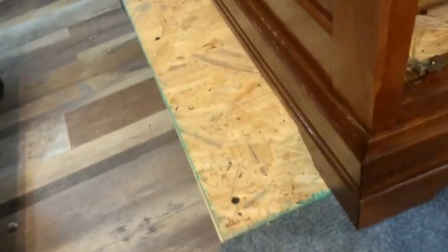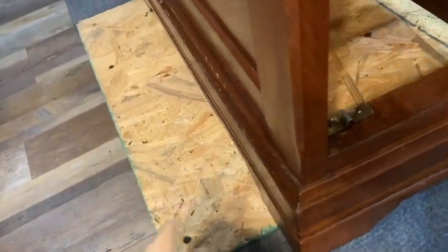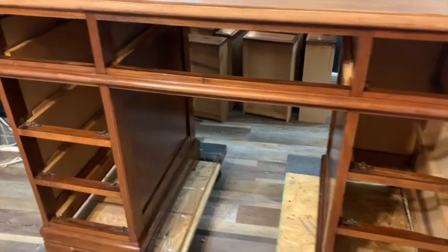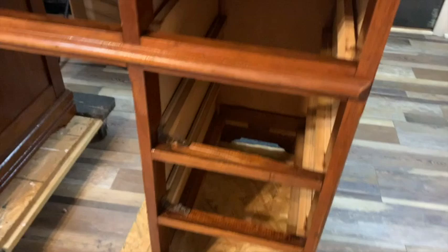To prime this desk, I used shellac. I also used the newest DIY paintbrush — it was actually really awesome for priming, I really enjoyed using it for this technique. From experience, I know that bleeders are going to bleed, so you really want to seal that in. I applied two coats and even put some on the inside of the drawers as well. Shellac dries fast. And this is what it looks like once it's all sealed — big difference!